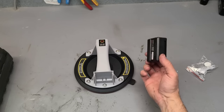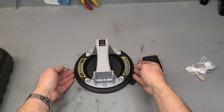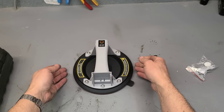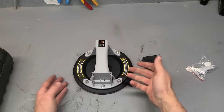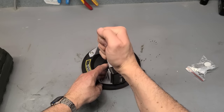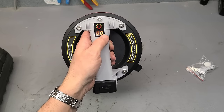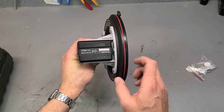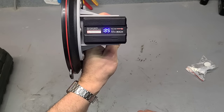The way these work: the battery runs a motor which runs a small vacuum pump that sucks all the air out from between the rubber pad and the surface, creating a vacuum — and that's what gives you the hold for lifting. They're very simple to use; the batteries push directly in. There's a wee LED display at the top to tell you how much vacuum you have, and a battery indicator as well whenever she's running.